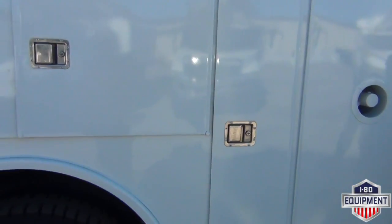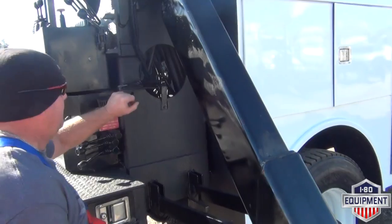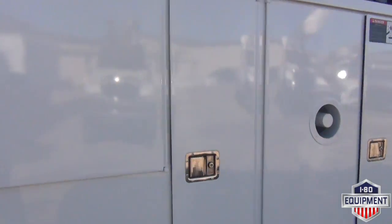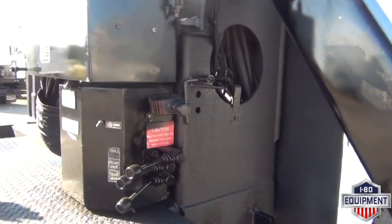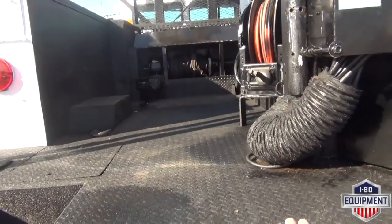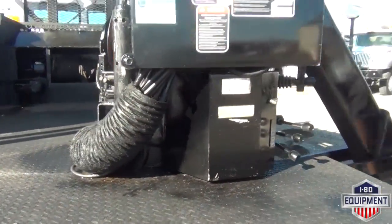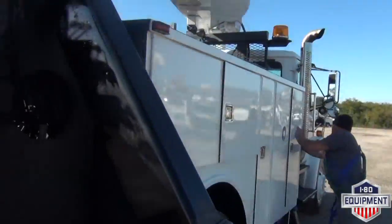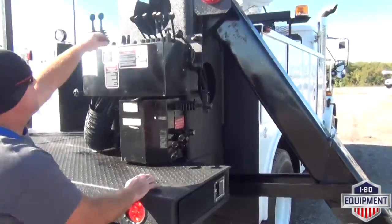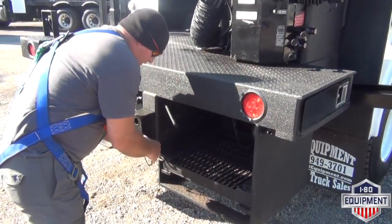Stops it. As you can see in the back of the bed, your winch is not engaging. So you press your lever in, then it engages. Pull your lever back out, it freewheels the winch. Nothing will run at all. Back down to standard control. Put your console away.